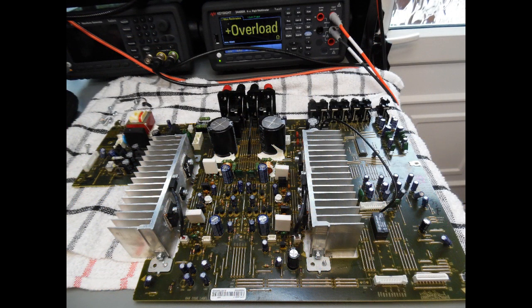The difficulty is that the protection system trips in quickly, which is very common with these startup boards, so I don't have the ability to make many more tests apart from keep resetting and making quick measurements. Modern service manuals don't give any voltages at different test points - just a schematic and exploded parts diagram. So you have to go back to basics: you know the right channel is working correctly but you have a faulty channel, and from experience when things are over-biased it may be a resistor gone high, a leaky transistor, or a faulty capacitor.